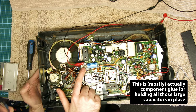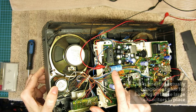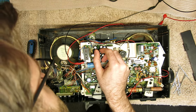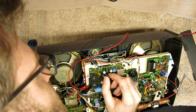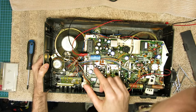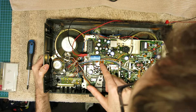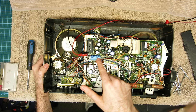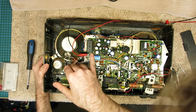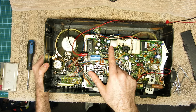Just looking around here I can see some gunk — probably from the battery leakage — that's left marks on the board. There's a capacitor here, a big Nichicon, the bottom of which looks awful. I also notice all these capacitors here are in line with it. These two chips I think will be our amplifiers, so it's a concern that the battery leakage has evidently out-gassed onto the board right where the amplifier section is.